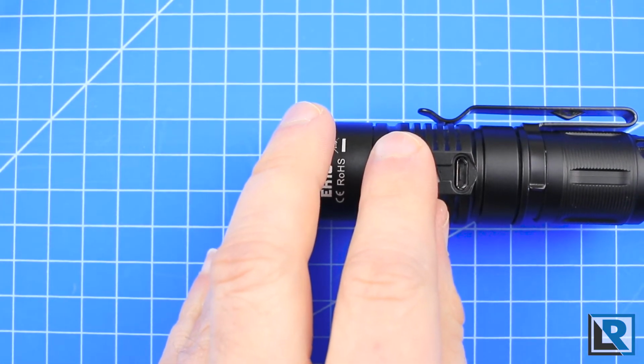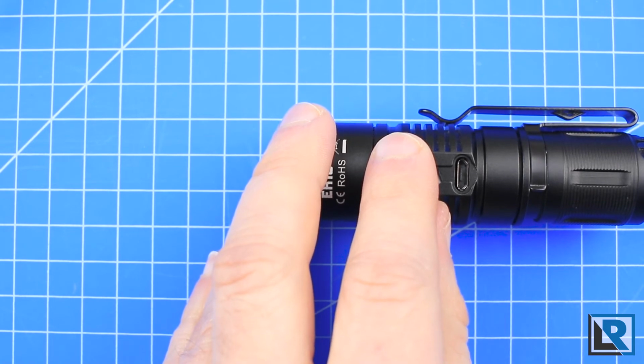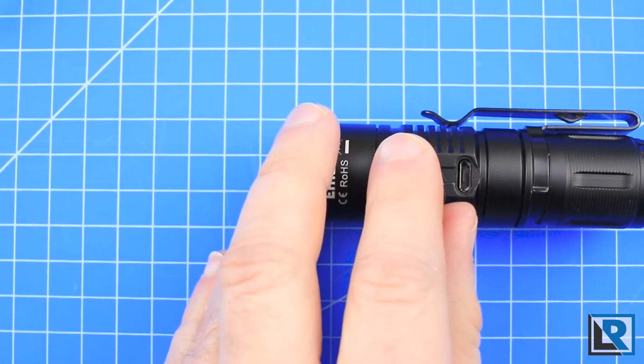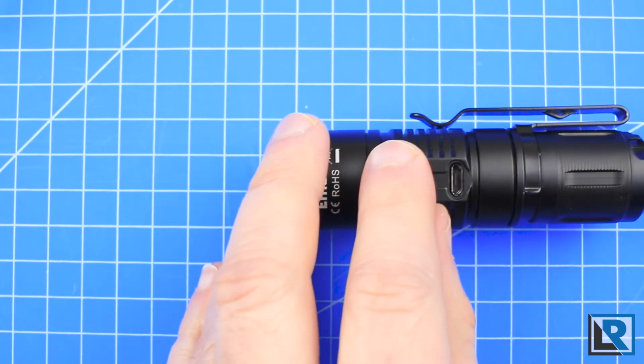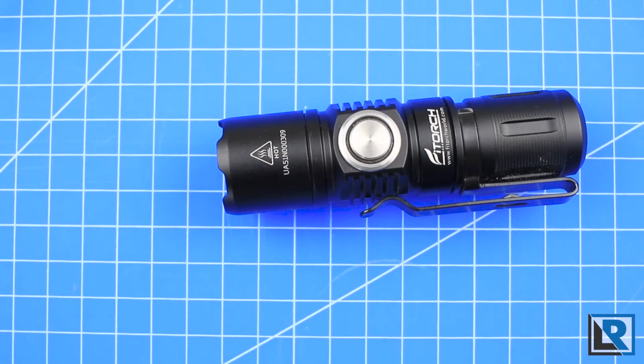The light can charge at 1 amp, but didn't hold there for terribly long, only about the first 30 minutes before it started slowing down as the battery reached capacity. Terminating voltage was 4.1 volts in my test, and total charge time was 1 hour and 9 minutes on the 800 milliamp hour 16340. So for me, the pros are it's quick and fast charging for a 16340.